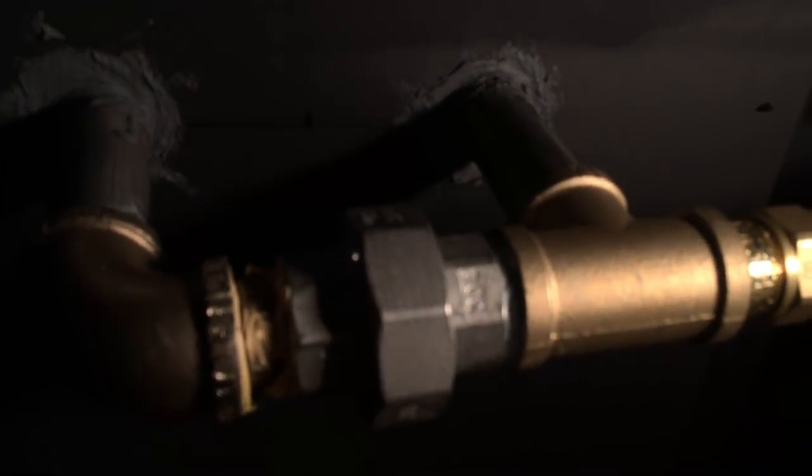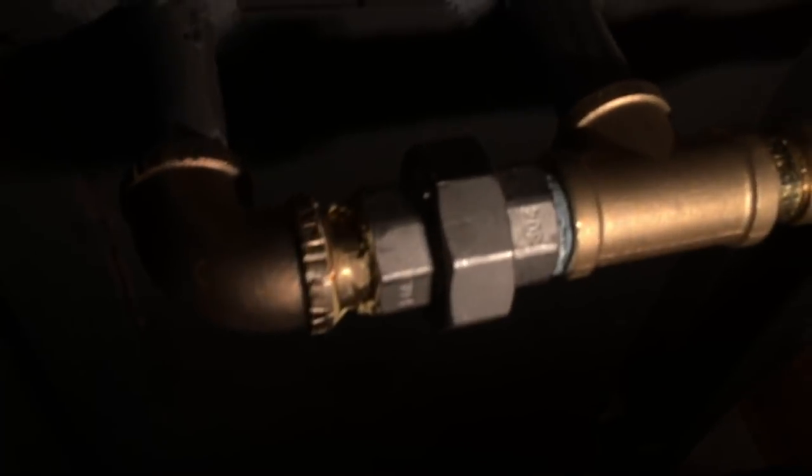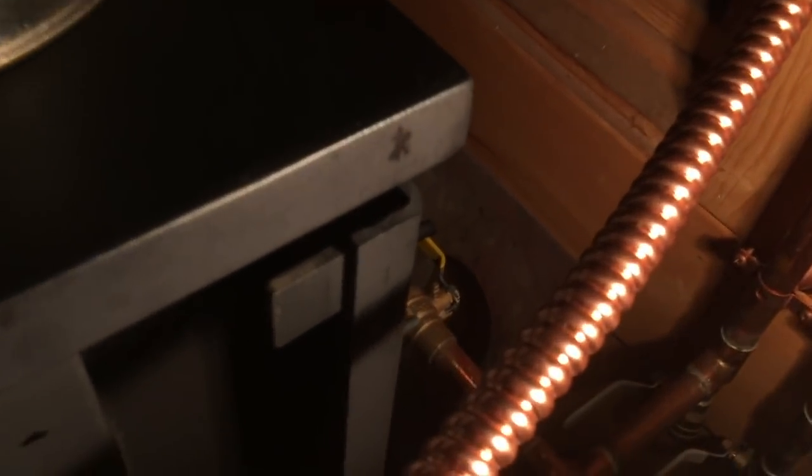I'm going to put the exterior stove panels on to keep the heat in, but I have them off now so you can see. I'm just testing the stove early on. There's refractory cement there, and then two stainless pipes come off — brass 90s, a stainless union, a brass T, and then this corrugated spiral copper, which gives us some flexibility. There are drains down here as well.